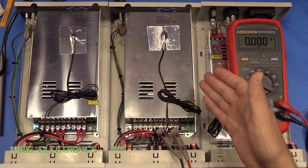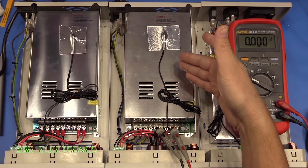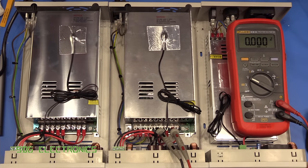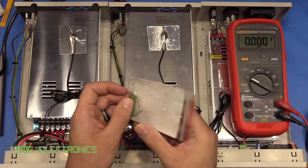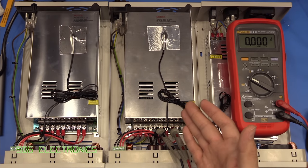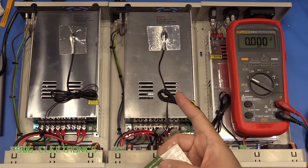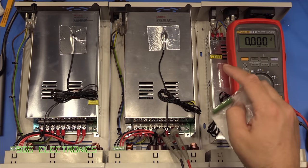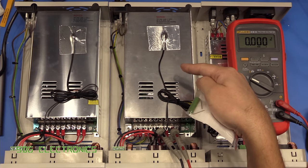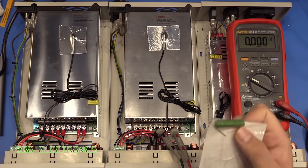But it has occurred to me that the power supply unit itself that converts from AC to DC is powered up all of the time, unless you switch it on and off at the back. There's a soft power switch on the front, but that relies on that 60 to 70 volt supply being active. So when you've got this resistor fitted, which is a 2K resistor, at 70 volts, that is dissipating almost 3 watts all the time. So that's probably not something that you want to leave on all the time. So if it really does need this, I might either consider buying a different power supply to fit in here, or seeing what we can do actually about the noise inside the power supply.